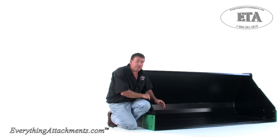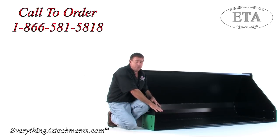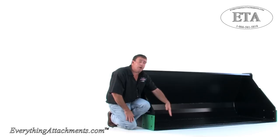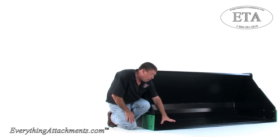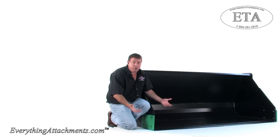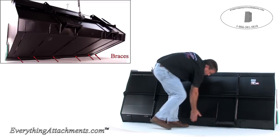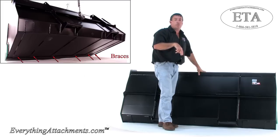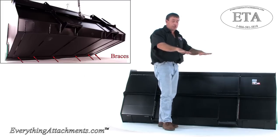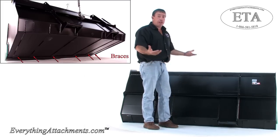He's redesigning this bucket; it uses these same holes as a bucket that we use for a manure bucket, which uses a different type of rake in the front. We're putting a more conventional bar type style litter bucket rails that are gonna go on, optional, to bolt on the front of this bucket to help you get that hard crusted litter up. All of these braces across here on the bottom run all the way up to the back of the front cutting edge. That's where the holes are drilled through for your front piece that's gonna be your forks or tines that go in front of this bucket to help you get up that litter.